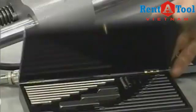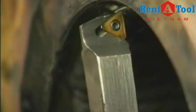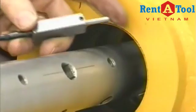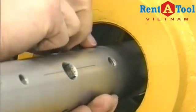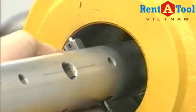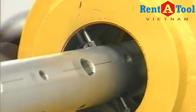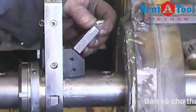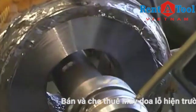York has developed many unique options that can help anyone using the York Portable Line Boring Machine. These half-inch carbide insert tools place the cutting surfaces in the center of the bore, substantially improving cutting performance. With the through-bar measuring tool, you can measure the bore without pulling the bar. This spring-loaded snap gauge fits in the tool ports on the York Boring Bars. You simply collapse the tool, tighten the set screw, and rapid traverse the tool into the bore. Loosen the set screw to capture the size of the bore, rapid traverse back out, remove the tool, and measure it with a micrometer. Our facing tool is designed to face off 90 degrees to the bore. Two tool ports allow a usable range of 2 to 10 inch diameters. Each revolution of the bar advances the cutting tool 5 one-thousandths of an inch.